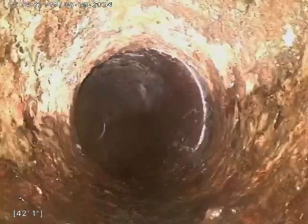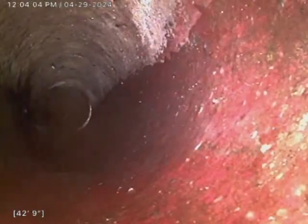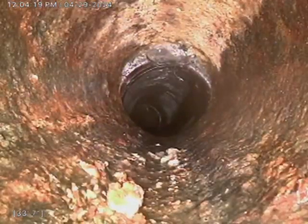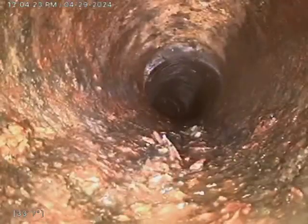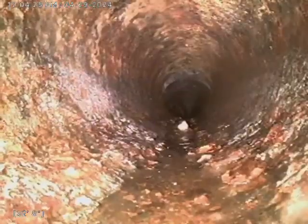Now we've transitioned from our clay tile to cast iron. This is most likely right at the edge of the foundation where these transitions are made. There we go with our cast iron system and back to some clay again. Interesting — it is an older system though. And back to cast iron. Nothing wrong with that, just notating. This is more likely the one that's inside the foundation, but at this point I'm going to stop guessing with the hit and miss spots.